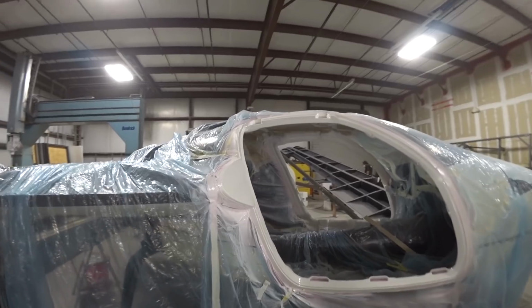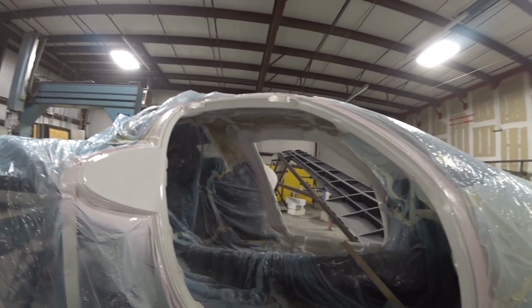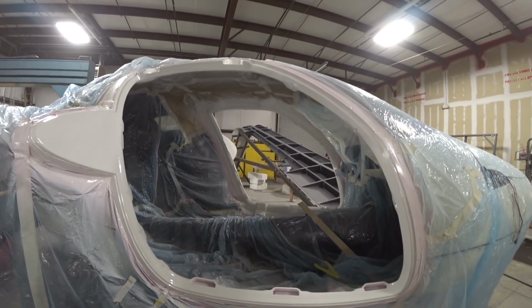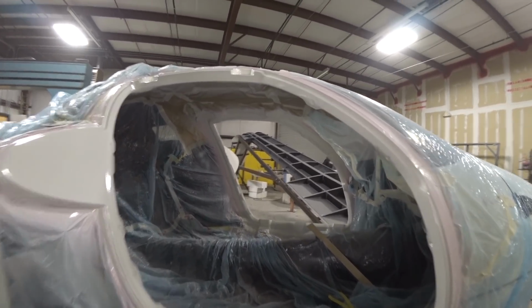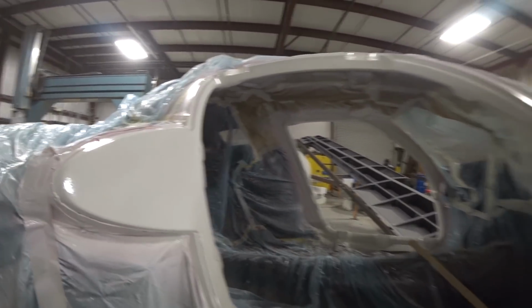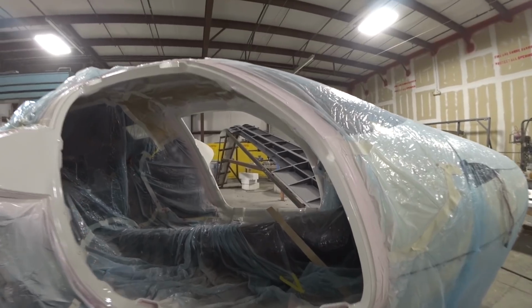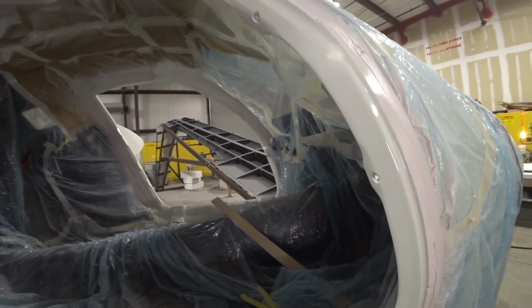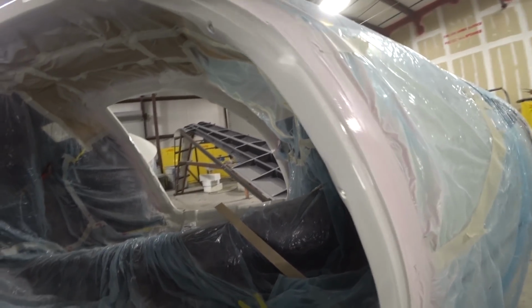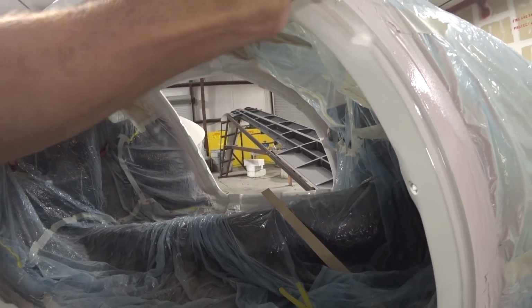And here's a close-up look at Jeff's handiwork there with the primer, so it's looking pretty nice. This time not as much needs to be done, just going to get a guide coat sprayed on there, and then a finish sanding with 320 wet. Prior to this I was sanding with 180 dry. It should come out pretty good with the 320 wet, and probably have a few little pinholes and stuff that need to be closed out, but nothing major.